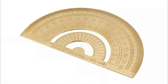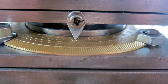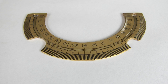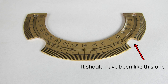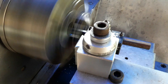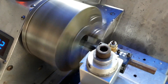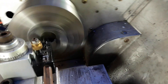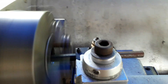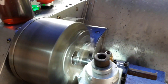One thing that was missing was a scale for the compound, and I was wondering how I was going to do that until I stumbled across a little brass protractor on Lazada. I ordered it and it showed up pretty promptly. I cut the center out of it, hit it with some black fingernail polish, sanded it up, and gave it a coat of clear lacquer — and it is what you see there. It's not marked the right way but it's better than nothing. While waiting for things to show up, I also trued up the jaws on this crappy three-jaw chuck — there are plenty of videos on YouTube on how to do this. I just ran the carbide tip boring bar backwards through it and cleaned the jaw tips up.